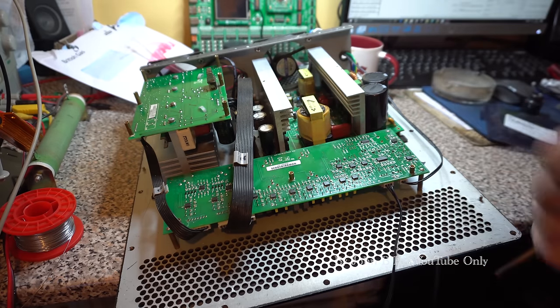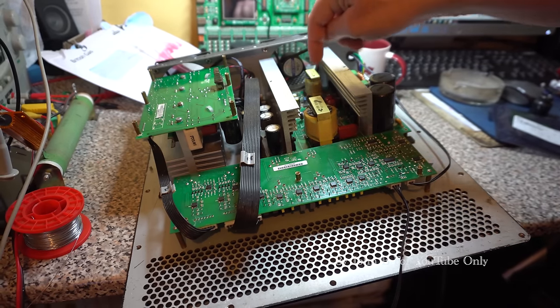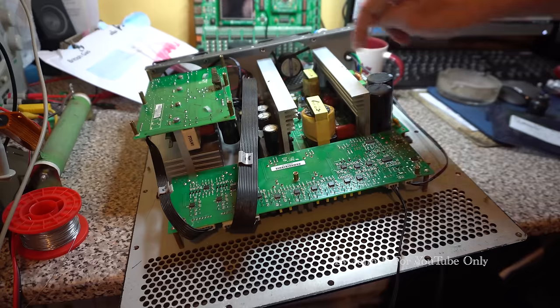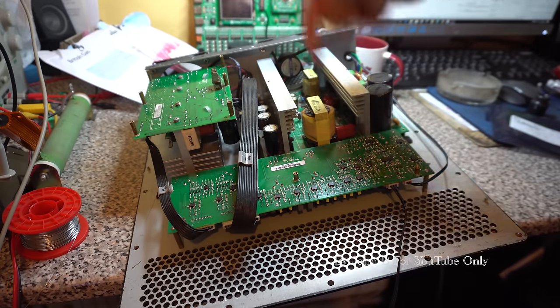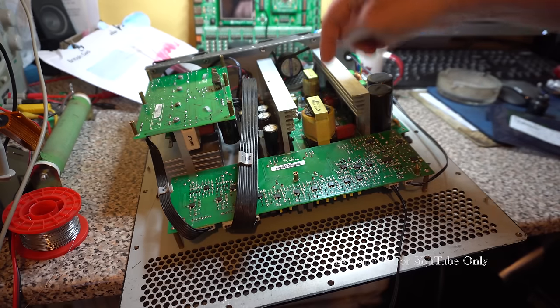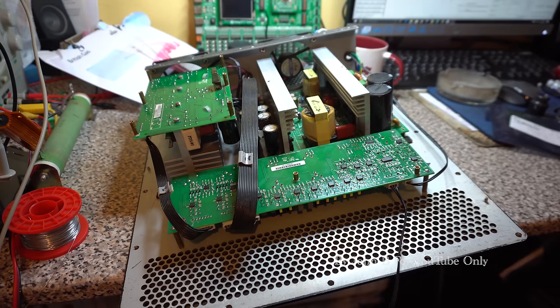Fingers crossed. So yeah, that was my fear. Someone had been at this power supply. They had repaired most of it, but yeah, just a wrong transistor. They probably could have been on it for weeks and weeks, because they would have replaced that transistor thinking it was okay because they replaced it. But they replaced it with the wrong sort. Let me put some signal into this and see if I can get something out of it.